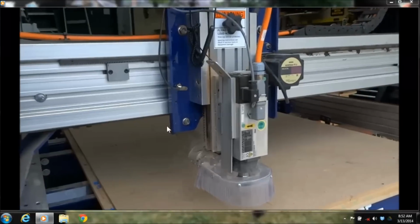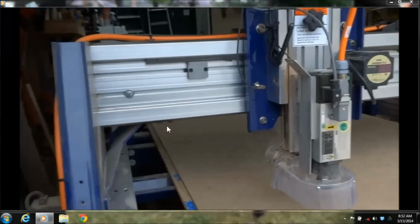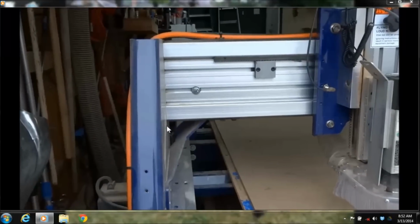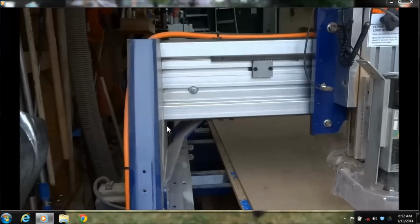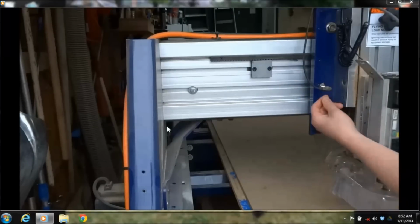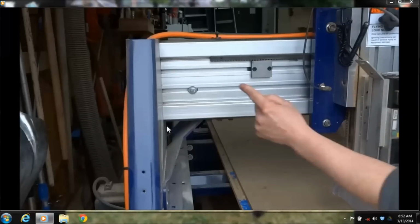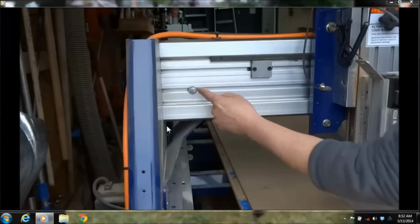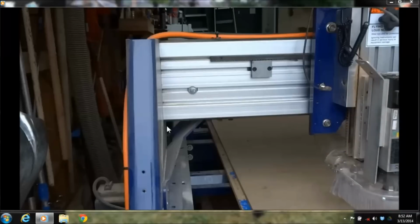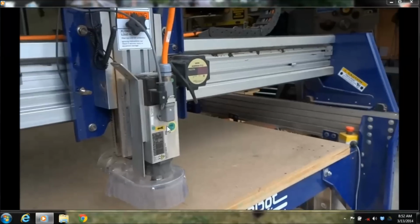How do we get our machine to go to the same location every time with a routine that we have built in? Well, what we have here first is the hard stop, which is the gray rectangle, and that's bolted on there. So if the pinion was coming along and it ran up under this, it would stop it in place. This is an electronic proximity switch that I'm touching here, and there's the target that it goes over. When that hovers over that, it will actually throw off an error saying, hey, you've matched your machine limits and you cannot go any further.